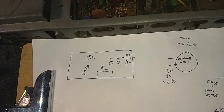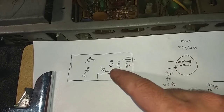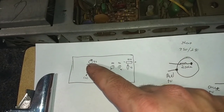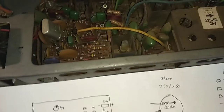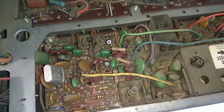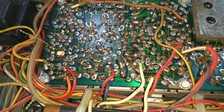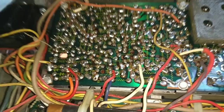So at a quick glance, this is what I've got: 100 µF at 25 volts, 10 µF at 50 volts, 100 µF at 25 volts again, 2 µF at 50 volts, 5 µF at 50, and an 8 µF at 50 which I'm just going to round up to 10. Hopefully they've got them marked clearly on the board as to their polarity, and I recorded and noted that. But hopefully the bottom side of the board is just as equally helpful, though I'm not counting my chickens before they hatch. And we can see the underside of the board is very congested.